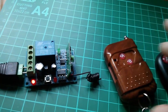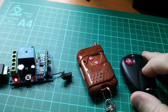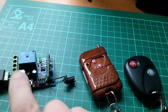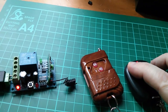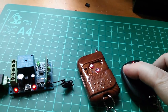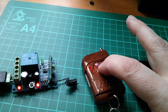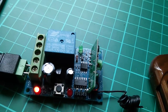Back to latching mode — A to turn it on, B to turn it off. But this remote control does nothing, because the unit has no knowledge of the code in it. So we press the button until the red light comes on — that's learning mode — and now it learns the code from this remote control. And it doesn't forget the code from the first remote control either; that one still works as well. It seems the codes are accumulated in that little EEPROM chip.